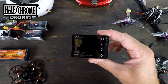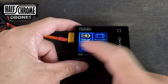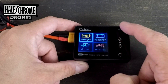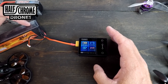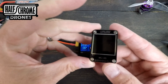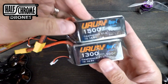You're going to need a larger battery plugged in as your power source. Looking at the screen — it's not a touch screen, though it looks like it should be. We've got Charger, Measure, Output, and Settings. These are your selection buttons, this is Back, and this is Enter. You can charge your phone here, plug in a servo to check a receiver, making it basically a battery checker and receiver checker — plus it will charge your batteries in the field.